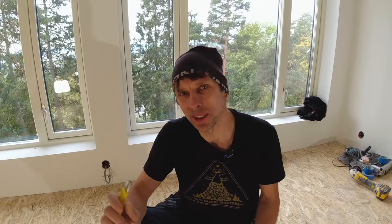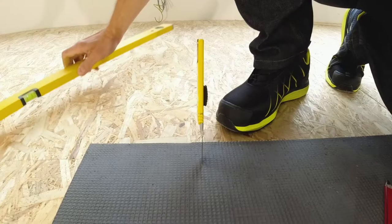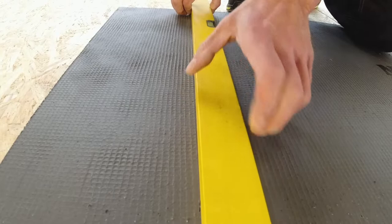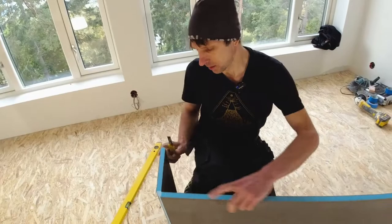A nice cut without drywall. To cut off a drywall or a piece of gypsum board or any other material, we're not using a pencil. We take a knife and a tape measure and make a cut on one side and on the other side. We leave the knife in the material, then attach the level to the knife. Keeping it with one hand, we align those two marks and cut like that. And look what happened — it looks so nice.